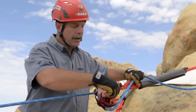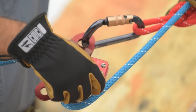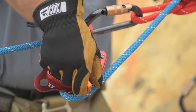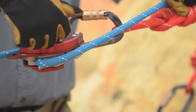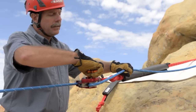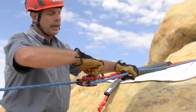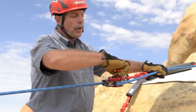Take the parking brake off, rotate the handle clockwise initially without lifting up on it. Then lift up on it and turn it into the maximum release position. By letting the rope move through your hand, you get a nice smooth descent or lowering operation.